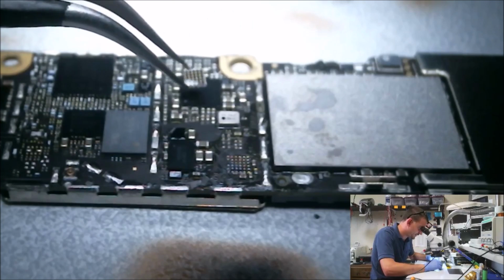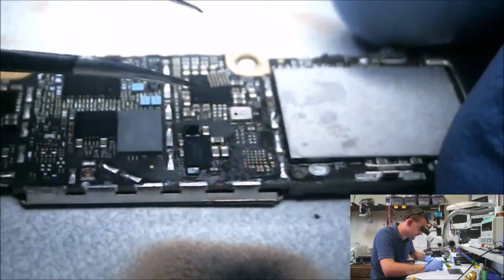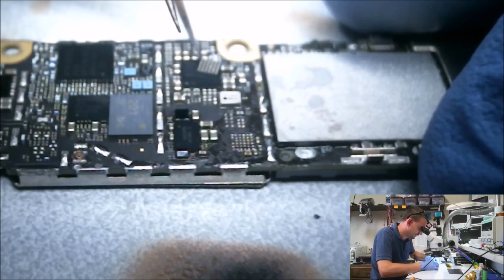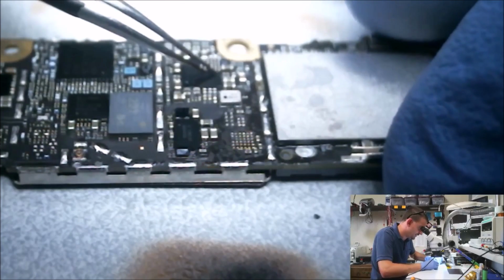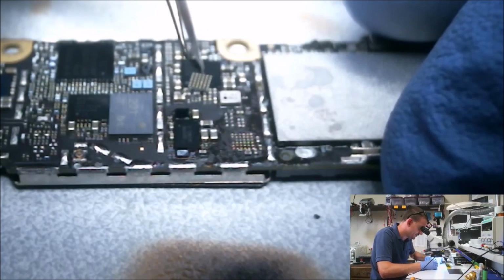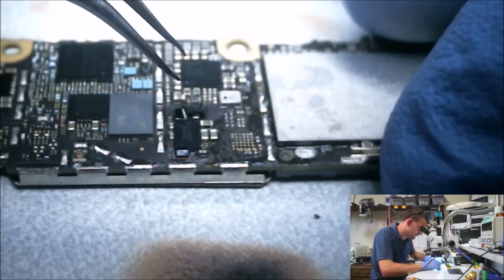Alright, I'm going to inspect the chip. Looks good. It is actually new. A lot of times when you order these, they come and they're not new. You can plainly tell they've been reballed from water-damaged phones. These came from microsolderingsupply.com. I believe that's Mark Schaefer's business with iPad Rehab.